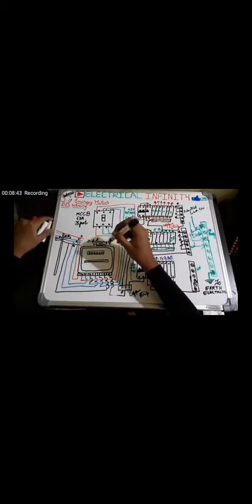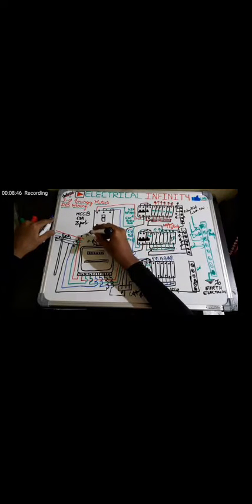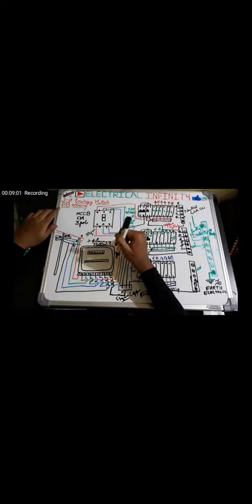So let's have a discussion on the sizing of cables too. The wires we are using here are basically 10 square mm. For the neutral wire, we are taking the size of the neutral cable as half that of the phase, so around 5 square mm. There are engineers who use the size of the neutral wire the same as that of the phase wire. So for the neutral wire, let us take this size as 10 square mm and this one 5 square mm, as there is less current in these wires.